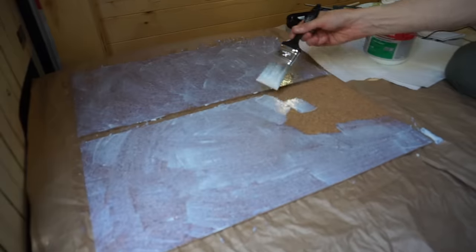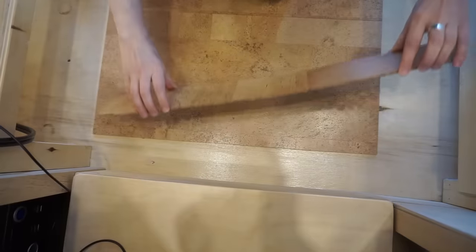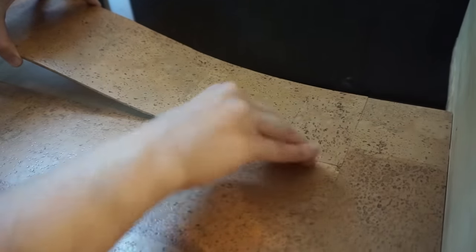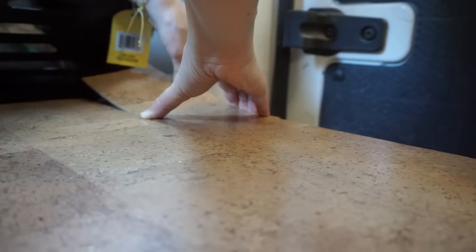One of the last steps was to finish the floor with cork tiles. We cut them all out to fit around the furniture and glued them down using low VOC contact cement. We chose cork because it's natural and it added another small layer of insulation where we stand, though we did still have to varnish it after installation so it's not a completely natural option.